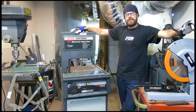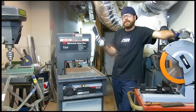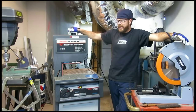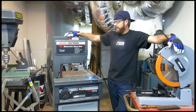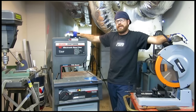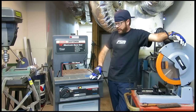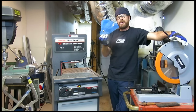Let's take a minute to talk about cutting tools. A lot of guys in their home garage might try to attack this aluminum with a jigsaw or a cutoff wheel. You could do that, but that's slow, dangerous, and no fun. Why do that when you can go on Craigslist and for about $100 to $150 buy a Craftsman 12-inch vertical bandsaw — an excellent wood cutting machine that I have never used to cut wood. I called up Industrial Blade in Santa Ana, California and said I want to cut aluminum with it — curves, circles, all kinds of funky shapes. They sold me blades about three-sixteenths of an inch wide, about $10 a piece, and those go through this like butter. Craigslist, $150 — get yourself one of these and start making brackets you can be proud of.